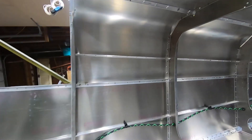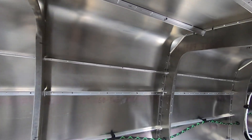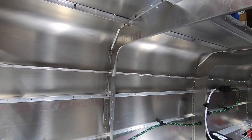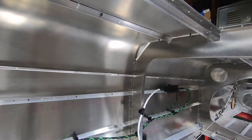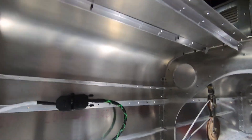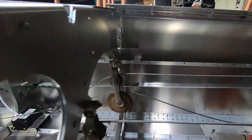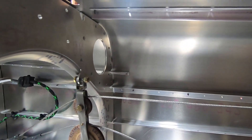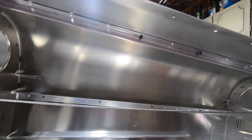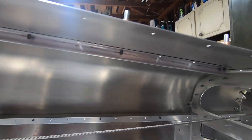I did learn that not all kits out there have the side stringers you see here on mine. I don't know if it was an addition or something they decided wasn't needed at some point, so don't be surprised if your skins aren't drilled for these and your bulkheads don't have the little triangle cutout for them. This is one of the many reasons you should build to the plans that came with your kit and not the most up-to-date version available online. The plans you get at the time of purchase match the parts in your kit.